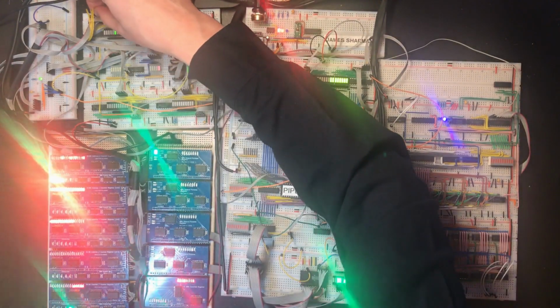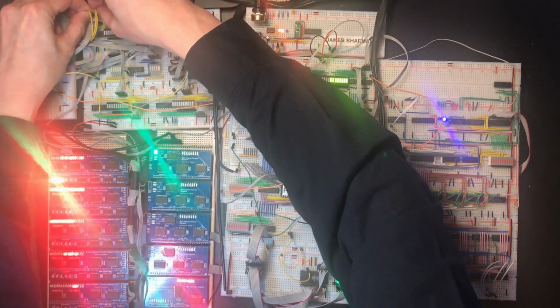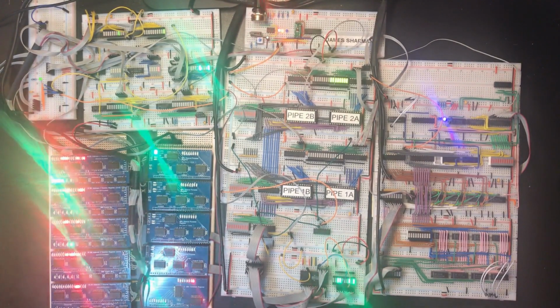Now let's try a different register. Oh, this is exhibiting the same problem. Same there. Okay, so this isn't a board-specific issue. This could be a mistake on the board, or it could be a mistake on the back plane. And if it's on the board, it could be with the asserting to the bus, or it could be a problem with loading back from it.